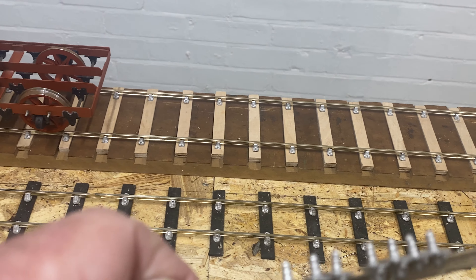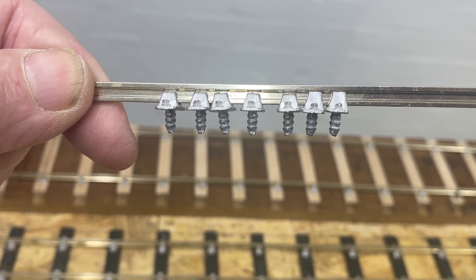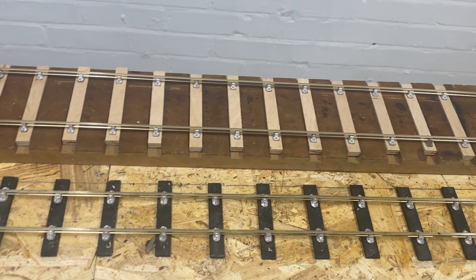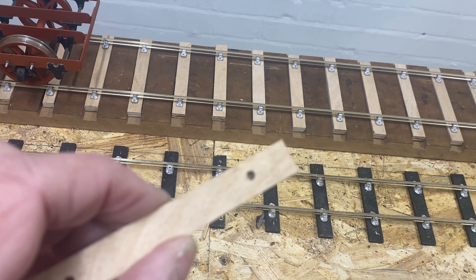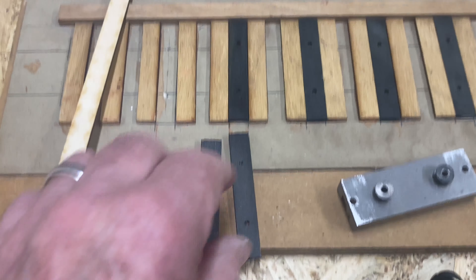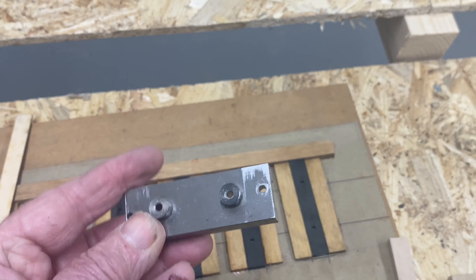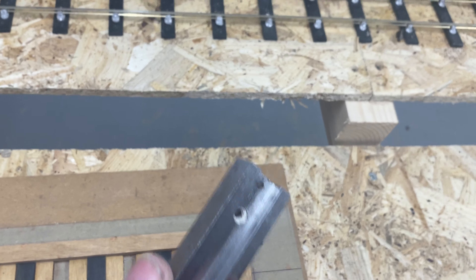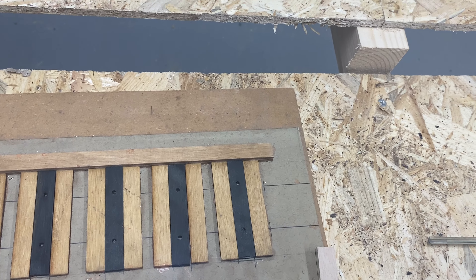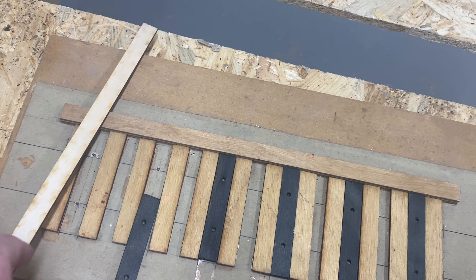And if I pick up a piece of track, you can see how they are cast. You can see that peg at the bottom has got a screw on it — that screw is pushed into a hole in the sleeper, like that there. Now I've got a jig for 32 millimetre, which is this one here. What I've done is I've drilled two holes, either end of that jig. That jig is where you place the sleeper in and drill through, and that gives me the spacing — or the gauge — for the railway. The same applies with the 16mm, the SM32. And there we are, there's a sleeper drilled ready to receive the chairs.